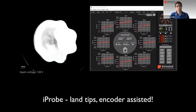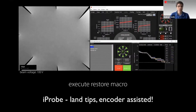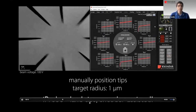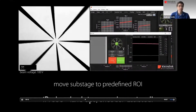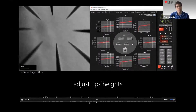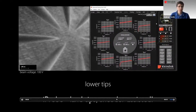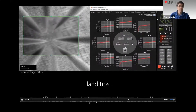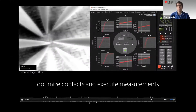So for the automated workflow, this whole sequence was done at 100 volts acceleration voltage. The first step is to restore the probes from their parked position into the working position, at a radius of approximately 40 microns. This is followed by a manual step where we pre-align the probes at a radius of one micron and set them in the frame. Then comes the automated step where we move the sample stage to within the probes' vicinity. The tips are then landed on the substrate — in this case, we're looking at a seven nanometer device — using drag and drop inputs with the mouse.